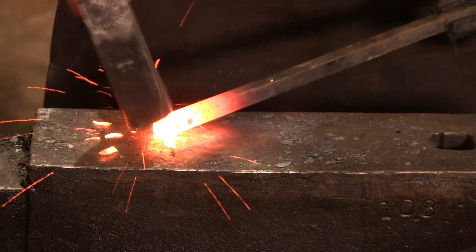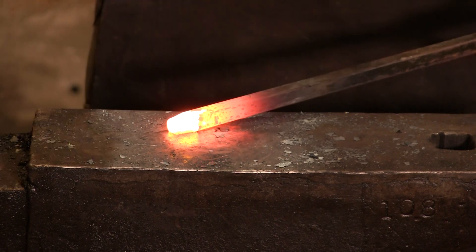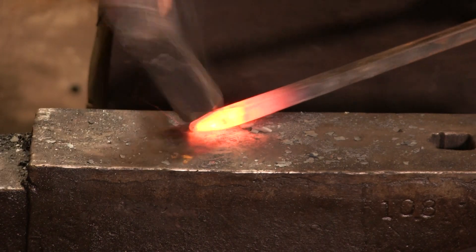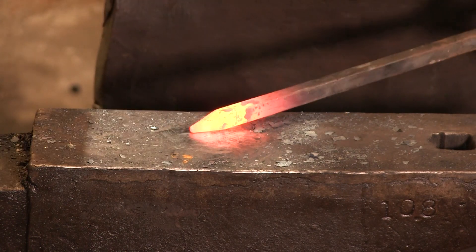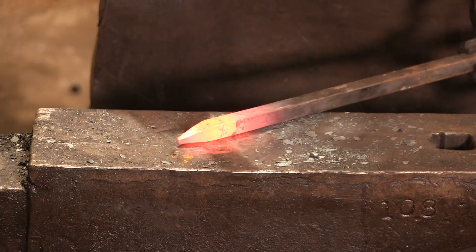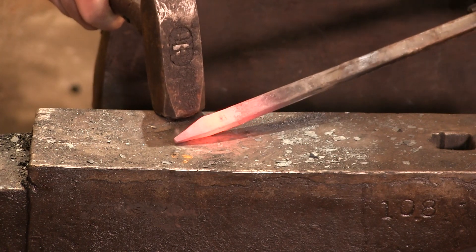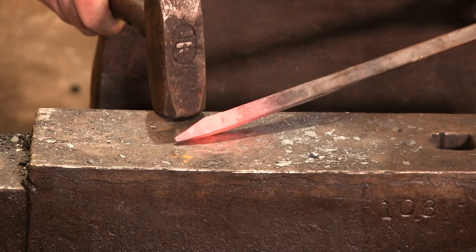Notice I'm raising my bar just a little bit to match the angle of my point. This doesn't need to be super sharp — you're not stabbing vampires or anything, you're just stabbing dirt. So make a short taper. And there you go, that simple. Make sure it's a little straight and it's that easy. This is something that is great practice if you repeat it over and over again, like you should.